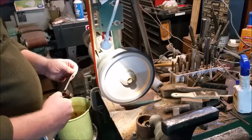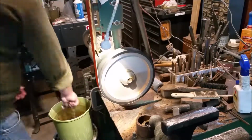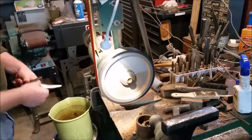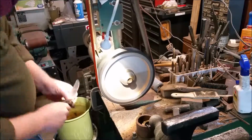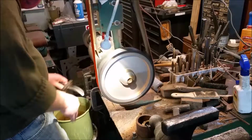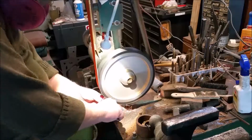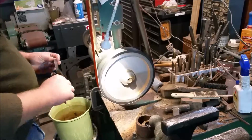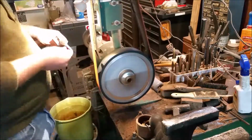And I think I'm using a fresh 60 grit ceramic belt for this. I think that was what I was using at the time. I like a nice sharp belt for grinding bevels specifically. It makes a huge difference in how clean you can get the bevel before having to hand sand. And I try not to grind so deep that I don't have any edge left for heat treat. I like to leave a 1/16 or so of an inch thickness on the cutting edge before heat treat. And I can typically hand sand my way to nearly a cutting edge.